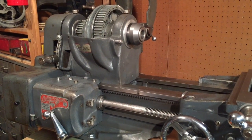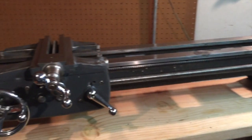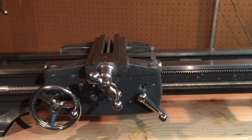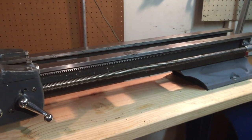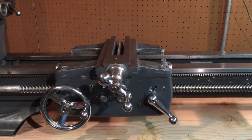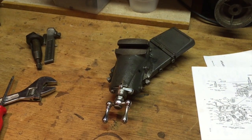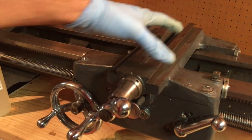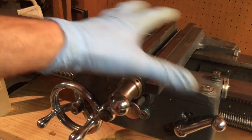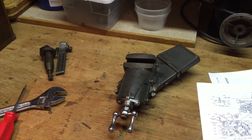Well, another part of the lathe is completed. Just a few more details — put on the tail stock, put on the tool post, and then we can start talking about how we're going to power this. This is the compound rest assembly. And the carriage — I had mistakenly called this whole thing the saddle, but this whole thing is the carriage assembly. This top part here is what you would consider the saddle, but this whole part along with the compound rest consists of the carriage assembly. So all you newbies out there, my mistake and we're going to move forward.